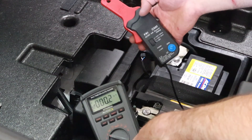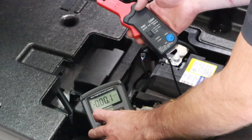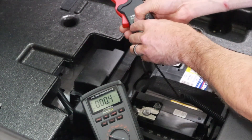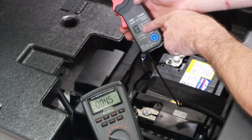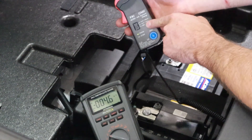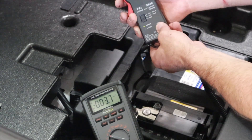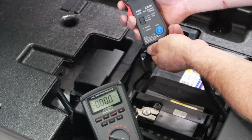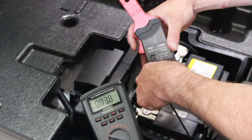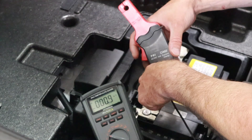To get this set up, I've got my leads plugged into my meter at the volt ports. I've selected DC volts and ranged it to get into the millivolt setting, and I've got to turn my amp clamp on. I'm gonna start with the lower setting where I get one millivolt per 10 milliamps of output, so we'll have to do some math after we get a reading. Once everything is turned on, I push and hold and let go of my zero button to try to get the meter to be about zero. It's pretty standard behavior that if I move my clamp, I'm gonna get some movement.